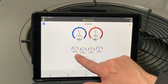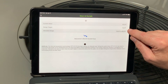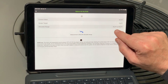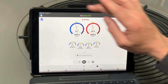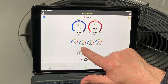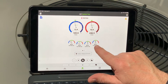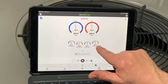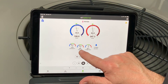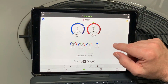You'll notice some different kinds of targets here. This return air dry bulb is 67 degrees. If I tap on that, it shows the current value is 67 — we want to be designed around 75 as the ideal place to check an air conditioner, but we can be between 70 and 85. Once you get outside that range, it's considered low load and not ideal for checking an AC system. So at 67 we're on the low side. Same thing with return air wet bulb — it's too low. The supply air wet bulb is coming out in the green because it's okay — even though the temperature coming in is low, the split is good. My enthalpy is on the low side, my airflow is okay but a little low, and my temperature split could indicate low airflow. I also have a high temperature split, so those two things sort of fall hand in hand.